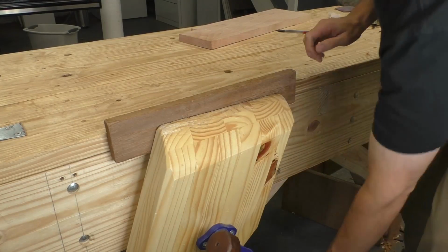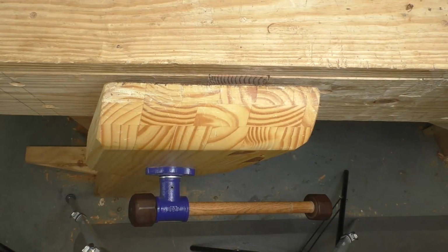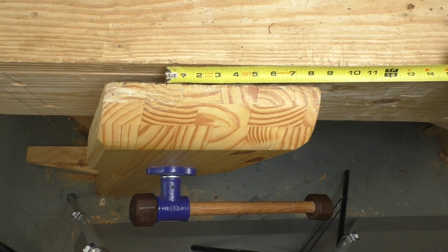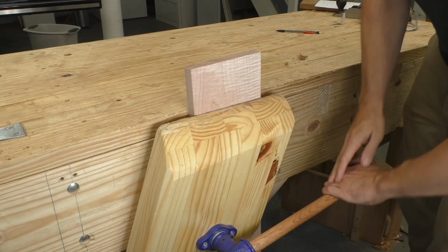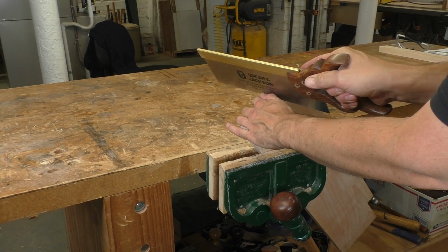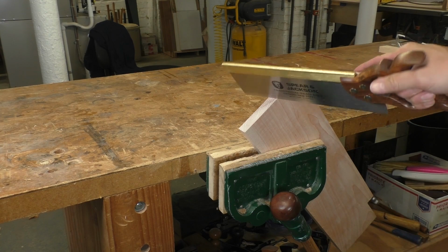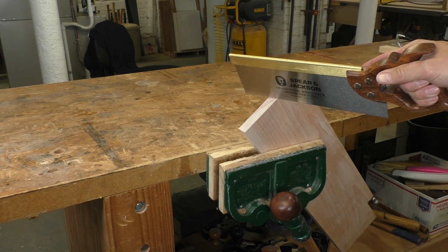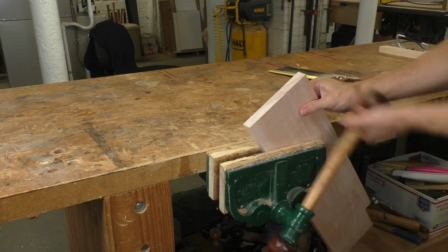This leg vise offers a hold that's just as solid as the cast iron vise, but because I built it at an angle, I have 8 inches of clamping space clear of the screw. Almost any board can be gripped straight up and down. If I compare that to my iron vise, where I've got these guide bars, well, they get in the way of vertical clamping. To get enough pressure on a wide board, you pretty much have to angle it, which is not great for things like dovetailing. A plumb board is way better for all kinds of joinery.